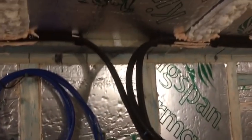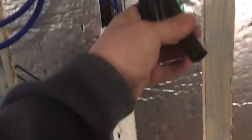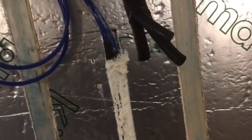This is the feeds, obviously, to the washing machine. Up here, you can see the ducting I've run, because there's going to be a cabinet above the bedroom bulkhead here. And obviously all the Wi-Fi cabling and the TV aerial cabling is going to come into here to a booster and the Wi-Fi router. And again, there's a supply to everything, so it'll all come together as we go down. You can see I've routed some more ducting right the way down here. It's chased in the wall, and that comes out where the media cabinet's going to be, where the TV cabinet's going.